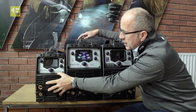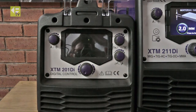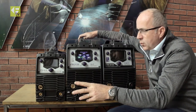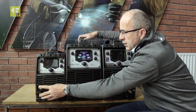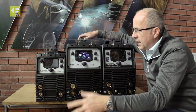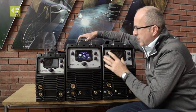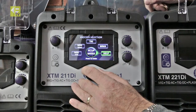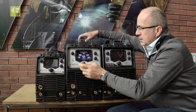The smallest model in the range is the XTM 201 DI, which takes a five kilo spool of wire. It will MIG weld — manual, synergic, gas or gasless flux core wire. You can also connect a TIG torch; it connects to the euro connector so you still get trigger control and lift TIG functionality. The display is slightly smaller but the functionality and the way you load programs is exactly the same as on the bigger machines.